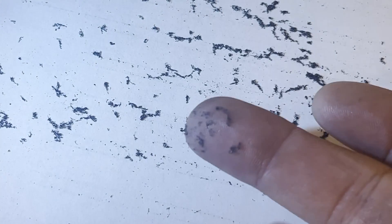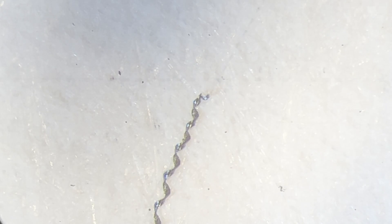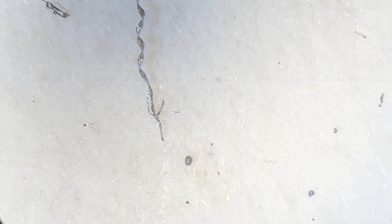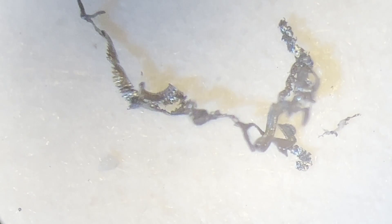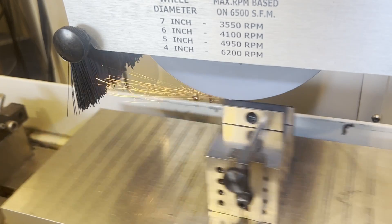The swarf from this process is like lathe swarf, just miniature — we have nice curly pieces and even some bird's nest. These are fairly nice-sized pieces of grinding swarf, and I suspect that might be why the part stays so cool, as the heat is coming off in the chip. Here's the 6-thou step-over pass.